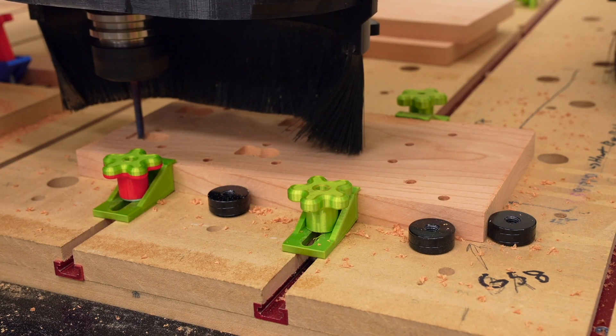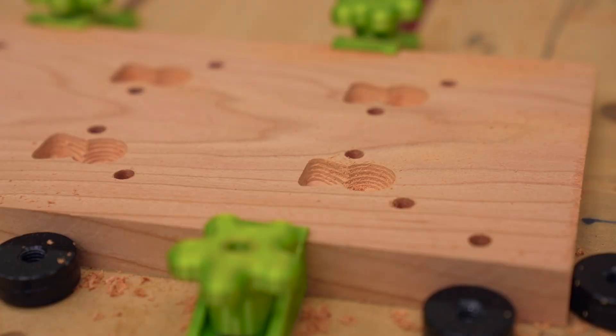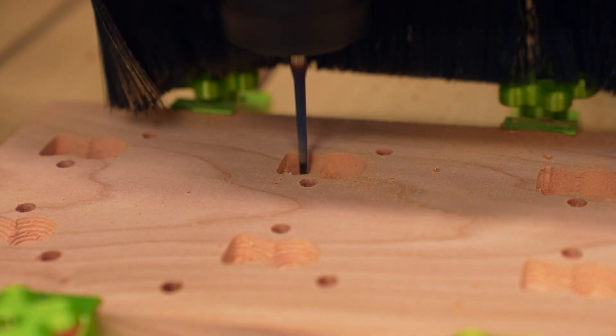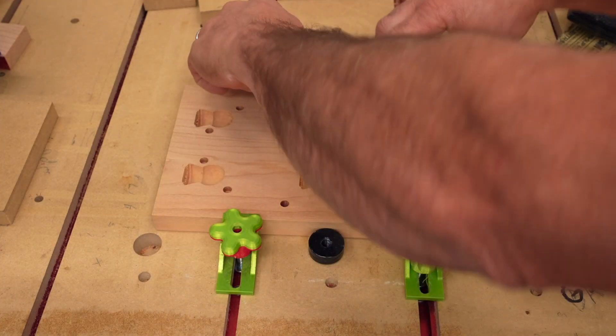This required precise two-sided operations on the machine. I split the design in half, and this allowed me to cut out the inside ball socket. The ball socket was machined out with a roughing pass and then a 3D finishing pass. You will also see a bunch of alignment holes, and these will come into play in just a little bit.